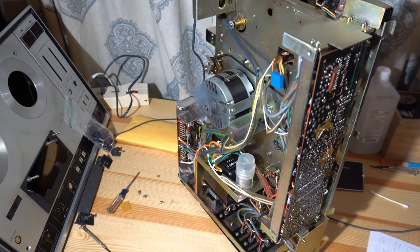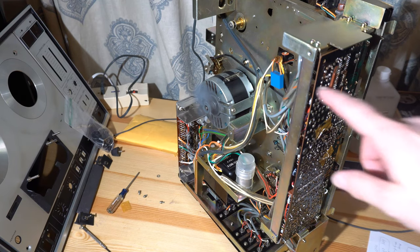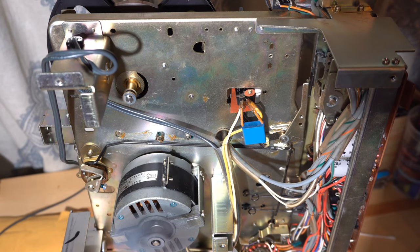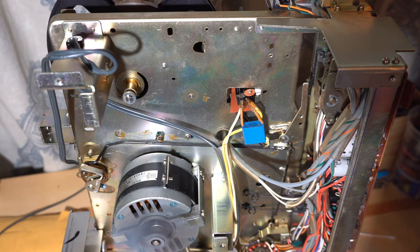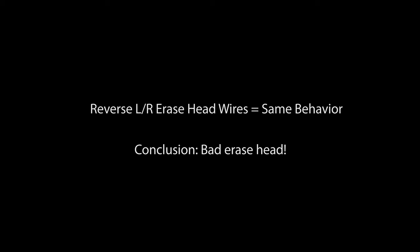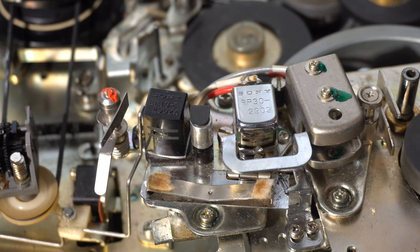This was made in the early 70s. This board has all the components — that fan keeps the motor cool. Taking that off would be a major hassle. What I ended up doing was following the head wires out and reversing the right and left head wires to basically prove whether it was the erase head or the circuit itself, because I wouldn't get a lot of conclusive results from the circuit alone. We replaced the erase head and that seemed to fix the problem.